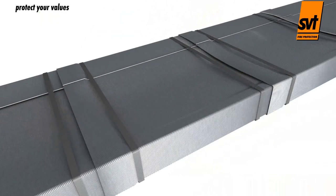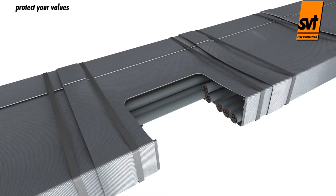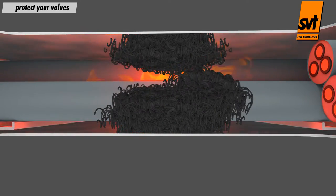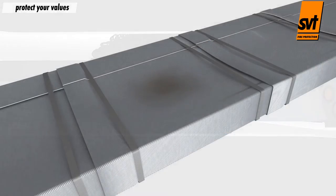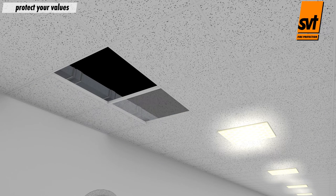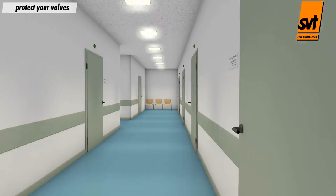When exposed to heat, PyroSafe DG Intumescent, based on expandable graphite, starts foaming up. After reaching its reaction temperature of approximately 150 degrees Celsius, the expandable graphite swells at high pressure — called foaming pressure — to many times its original volume. This is how, along with other components in the Intumescent, a relatively stable layer of insulation forms, wrapped tightly around the cable and closing off the cross section of the cable line. The fire goes out.